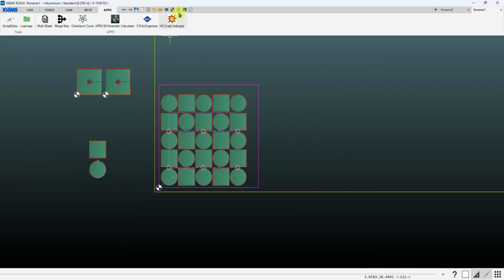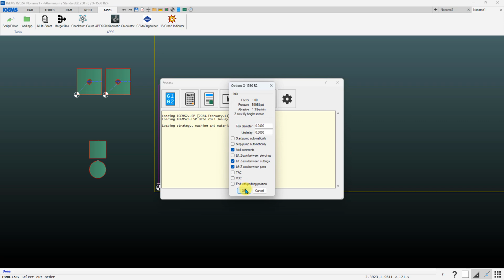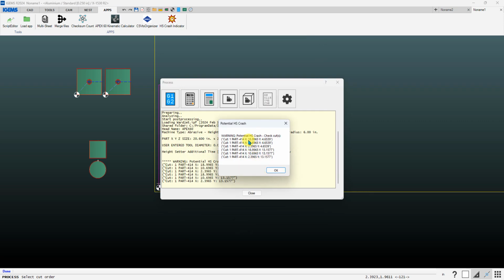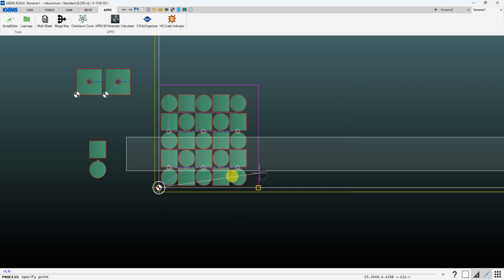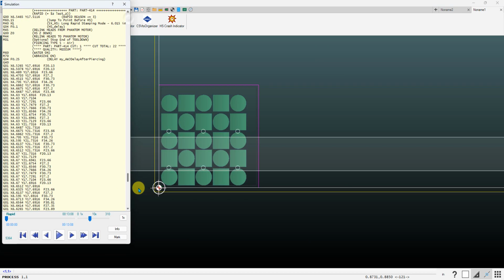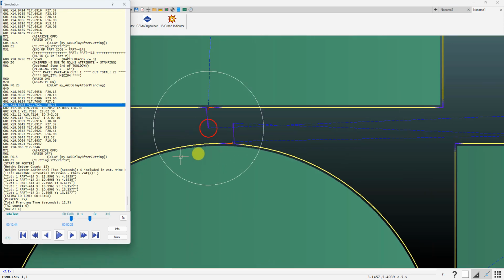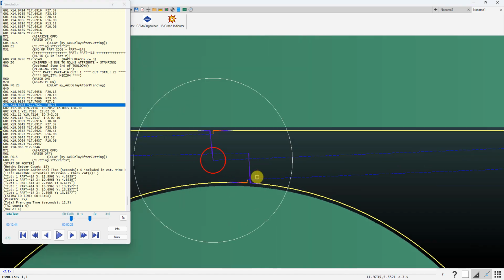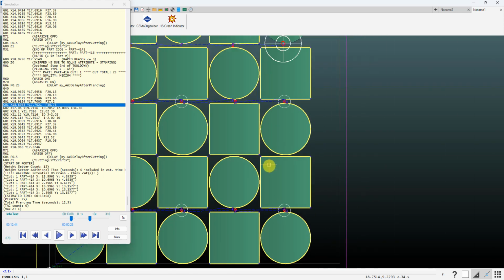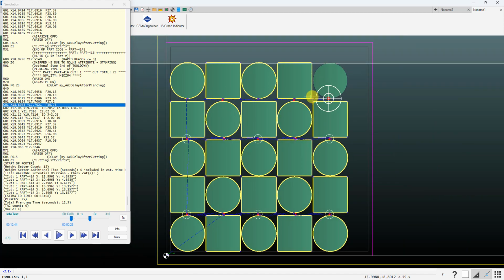And then it may be easier at this point if you go back in and do the 2D simulation to then overlay this. And again, if we scroll towards the end here, you can look and see, all right, so there's one. So yeah, we've got a pierce here, height set there, but not an issue. And then you can very easily go through and see if there's any real issues to be concerned about, which there wouldn't be in this scenario.